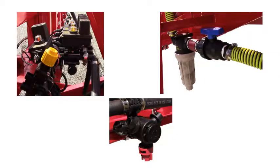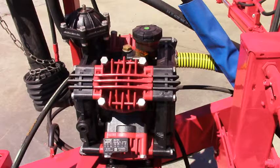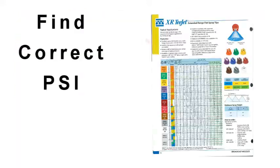For any equipment, you must know your limitations. The maximum pressure of the pump is much higher than the components. So if you set the pump too high, you will damage the parts. Do not operate until you have determined your operating pressure and set a limit that does not exceed 90 psi.